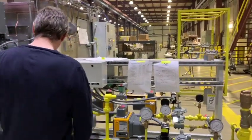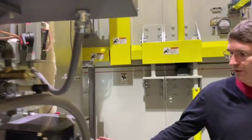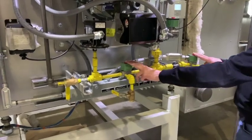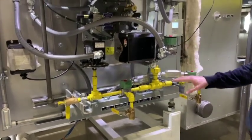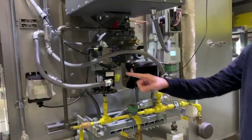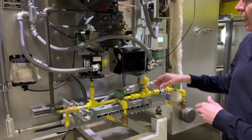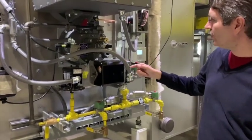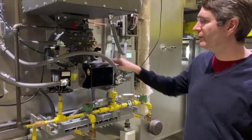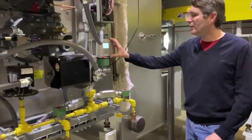There are also vent solenoids on the dryer. This burner system right here — here's the pilot line that would connect to here. Again we have two blocking valves and a vent valve. Once the flame safeguard approves it to light, all these valves open and the igniter fires off right here, causing the spark which lights off the pilot. Then your main blocking valves open up and your control valve changes the gas and air ratio to allow your Maxon burner to run. Maxon is the preferred burner for this dryer.